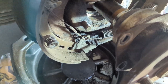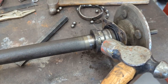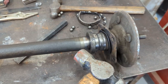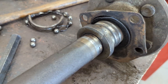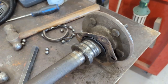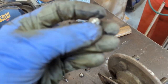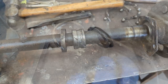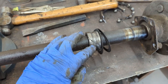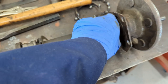Before I take it out, I'm going to make sure my new bearings are the right ones - probably a good idea before you start cutting it apart. That collar didn't give me much of a fight. I can hear it snap, so it's loose. I'll tap it off. I only cut halfway through it, a little better than halfway, and it cracked right through. I scored it, hit it with the chisel, popped it off, slid it back, and that's ready. That bearing was pretty much dried right out - no wonder it was loose.